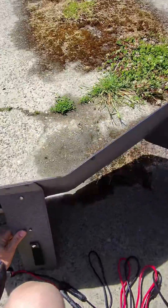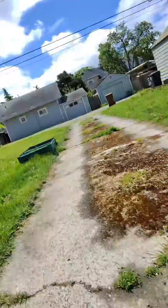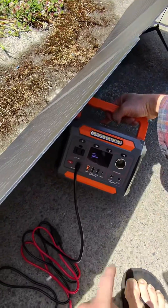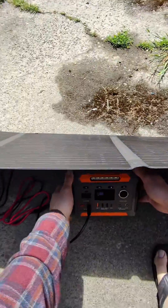Let's kick out our stands and get some more angle going. The sun is actually over there. I just got 41 watts by changing the angle — you can get up to 100 watts out of this.